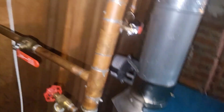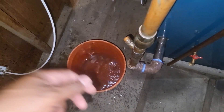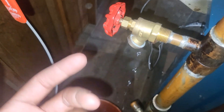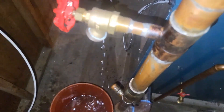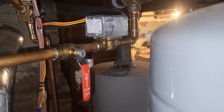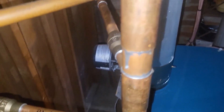Let me get my bucket and valve this off. In a perfect world you'd use a hose, because when I opened the drain I wasn't getting air at first, then some came out after a couple of seconds. Typically if you have a large amount of air, even with just a bucket, you either hear knocking or you get air for a couple of seconds before a full stream of water appears. I'm going to fill the boiler back up, then check the radiators on the second floor with the other zones valved off.